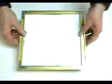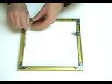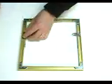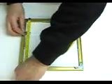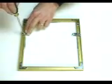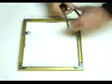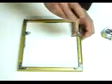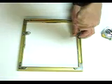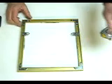Now that you're all done with that, identify the top, and then put your wire hangers 1/3 of the way down from the top. You can measure down. Within 1/8 of an inch is what we usually do. Tighten those up. Usually that third of the way down goes to the middle of the wire hanger. Okay, and you'll be given wire, and you'll string that on there.